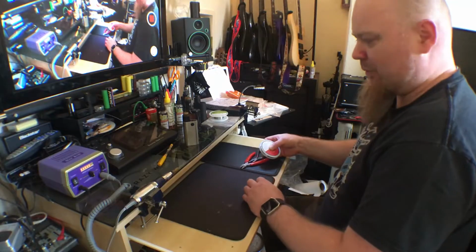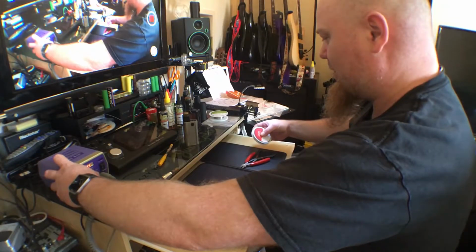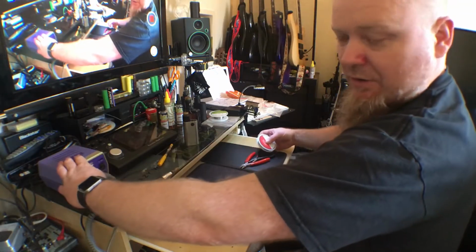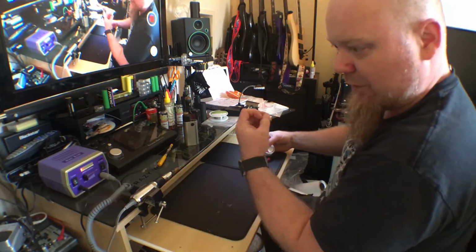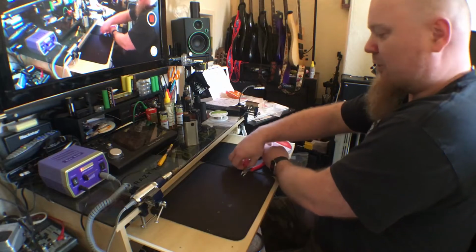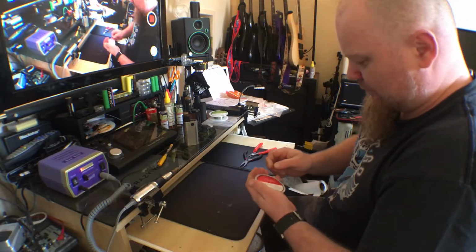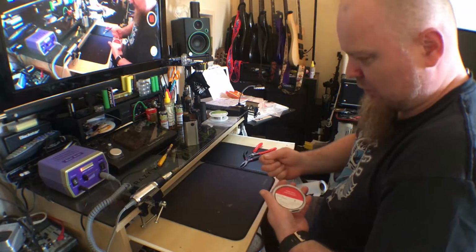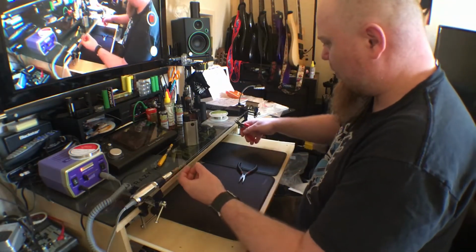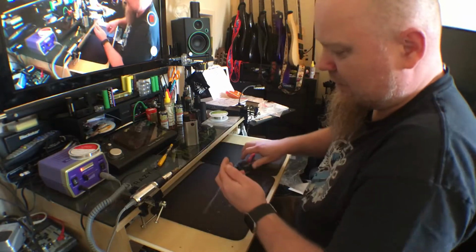Making them by hand, there's a little tip that'll save you a bit of headache later. So once you get to the end of your wire, stop it. If you keep the direction of your drill the same way and let the wire come back on itself, it'll lock it on at one end, which makes things a bit easier. So just roll it across itself a couple of times, and you can cut that free and try to secure it back to the spool so it doesn't explode on you. Then cut the end you've locked first free, and then this end.